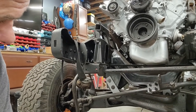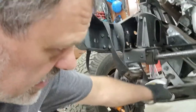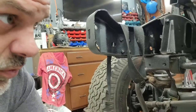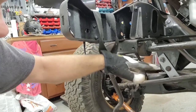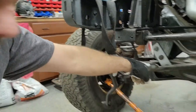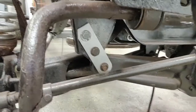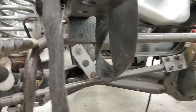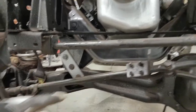One thing I see a lot of people making a mistake on is they try to put their mount directly in line with their front axle traction beam pivot point. You've got to think of these twin I-beams as actually just a single set of large lower wishbones — because that's what they are. When it's pivoting, drooping, or compressing, you need to account for where those points are. On mine I've got them just under the frame, which is pretty much in line with how the factory Fords were set up — just further back down the frame. Sometimes setting those inboard on the frame gives you a bit more of an A-arm type swing suspension, rather than this slightly awkward setup where you get a caster and camber change throughout your travel.